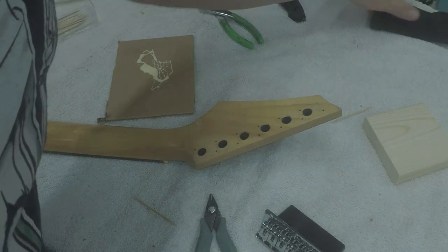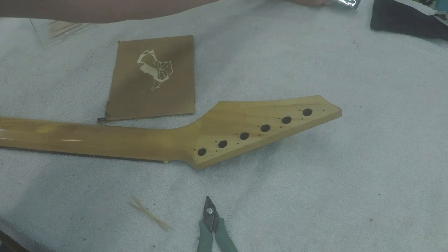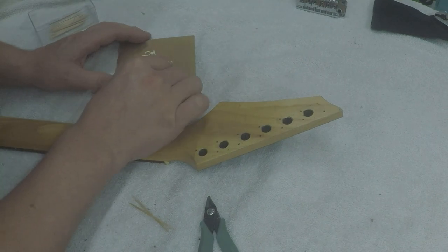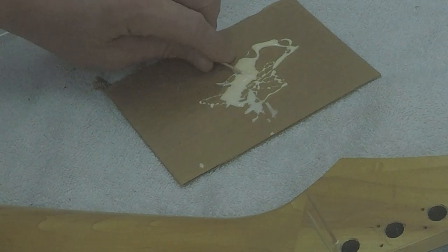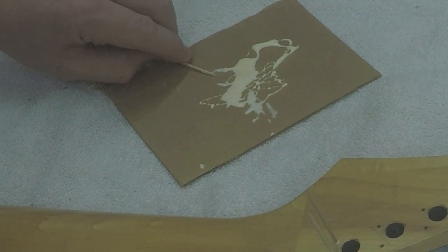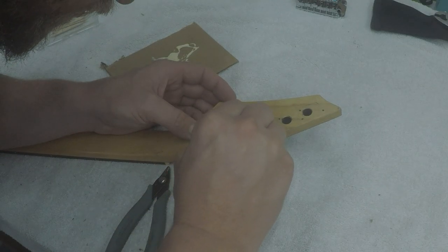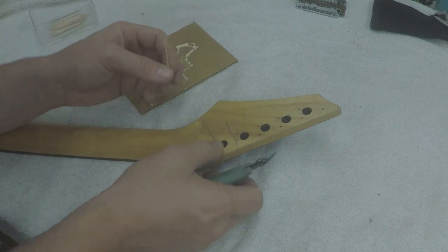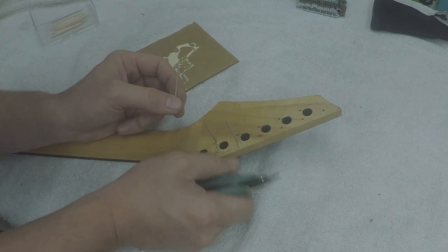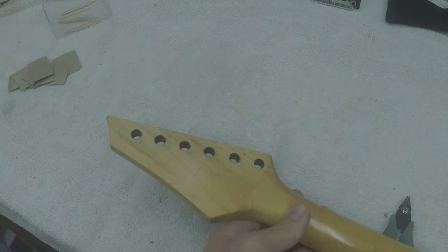Now the guitar is painted, but there's still a lot to do. We'll move on to the headstock. The holes in the back of the headstock are still there from the stock tuners. I like to fill those in using toothpicks and some wood glue. I pour wood glue onto a square of cardboard, then roll the end of the toothpick in the glue — you really don't need that much, so you can roll the toothpick on a dry piece of cardboard to remove excess. Then simply insert the glue-coated toothpick in the hole. You can cut off the extra piece that is protruding and use it in the next hole. I use flush-cutting wire cutters to remove the extra length. After filling all the holes, it looks better, but you can still see where the original tuners sat, so we'll come back to this after the glue dries.